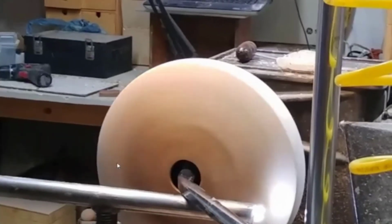Okay, so now I've switched to the gooseneck tool. You see, it's a much thicker shaft, or the same size shaft, but you don't have all that protrusion at the end, which was the small diameter stuff that is more prone to torquing. You could sort of see what I'm doing up here. Very close to reaching the final wall thickness as I'm going from here. I'm going to be traveling up like this, and then again working on this area, which is the problem area.